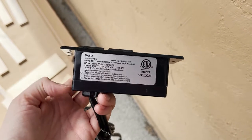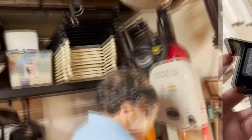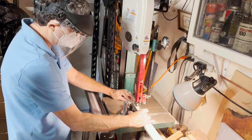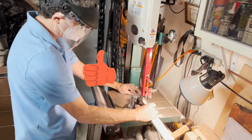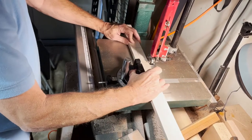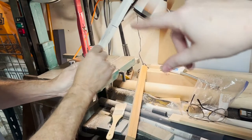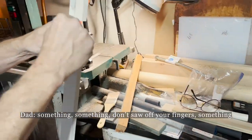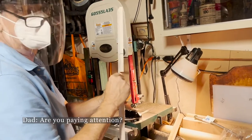Note that there's a bit of a taper on the outlet, so when taking measurements for the cut, take them at the top. Now we head to my parents' garage to perform the cuts. If you don't have a band saw, you can use a jigsaw, or carefully use a hacksaw with a clamp on the miter box. Please use safety goggles and masks — very fashionable. Here my dad demonstrates the steady back-and-forth movement before I give it a go. Make a lot of little cuts and then chisel it out. It's cleaner to space cuts less than the width of the blade, though it takes forever.